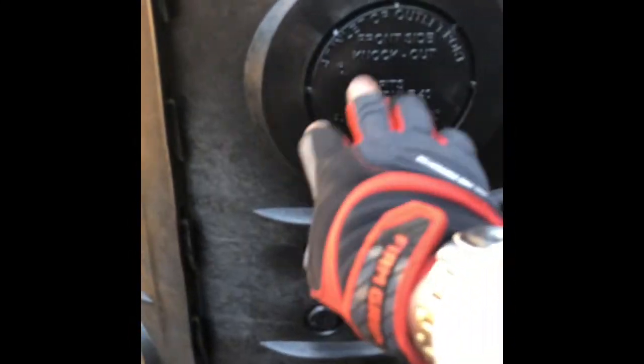On the barrel here, my inlet's going to be just below where these knockouts are. These smaller knockouts I'm going to take all those out below that level where the inlet is, so that it can seep through and dissipate about 18 inches.